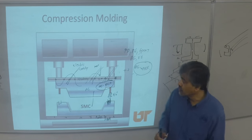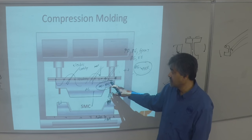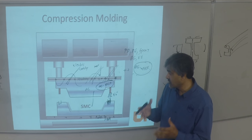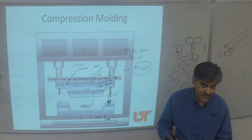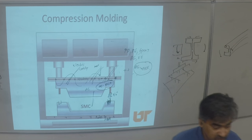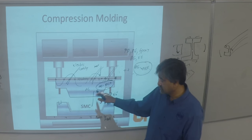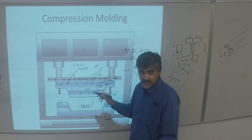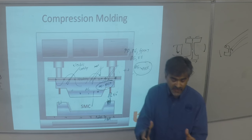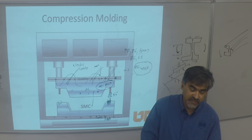When oil heating falls short for higher-temperature materials, you gun-drill the tool and insert cartridge heaters — electrical cartridge heaters connected to a resistance box that builds up heat in the tool through electrical energy. Cartridge heaters can take the tool up to 700–800°F, which is typical for most materials you can mold in this range unless you're doing ceramics.